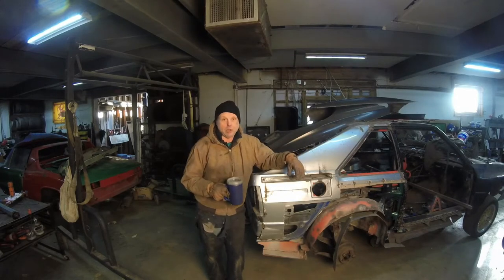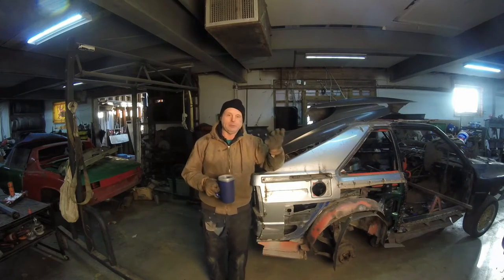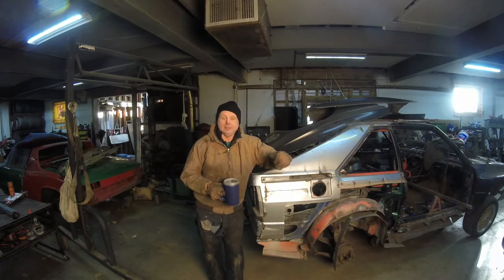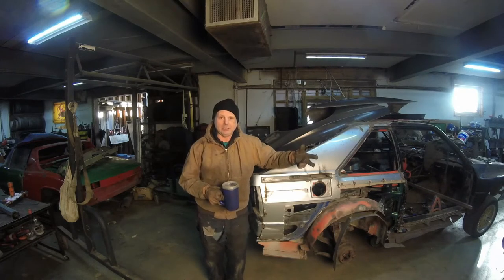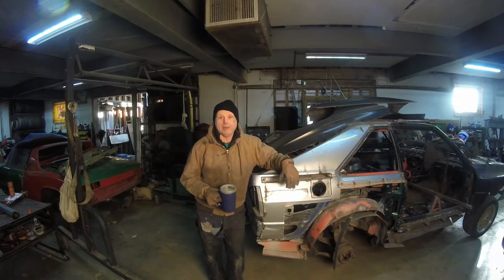Another thing was my welder was really screwing up. It was fusing one side of the metal, and it looked like it fused the other side, but it wasn't. It was really odd. So what did I do? Replace the gun, didn't work. Replace the potentiometer, didn't work. Clean and tested the diodes, didn't work. Screw it, bought another welder.